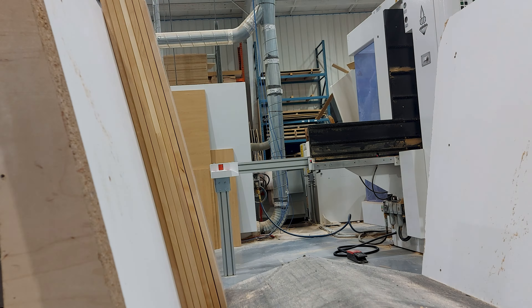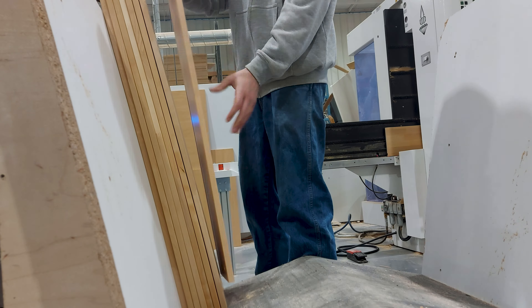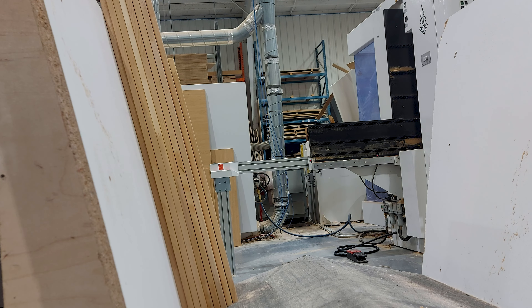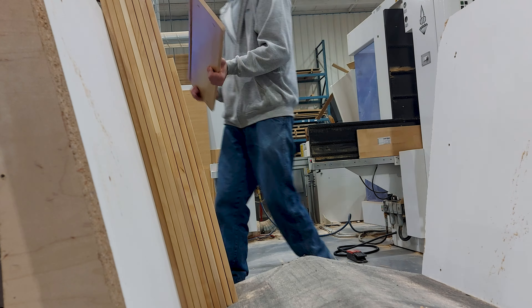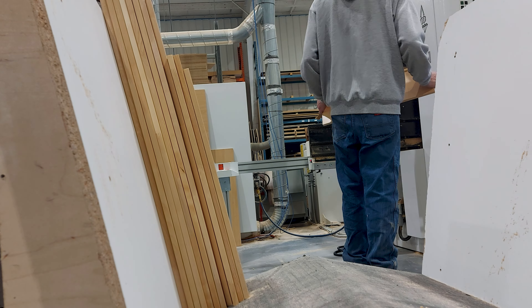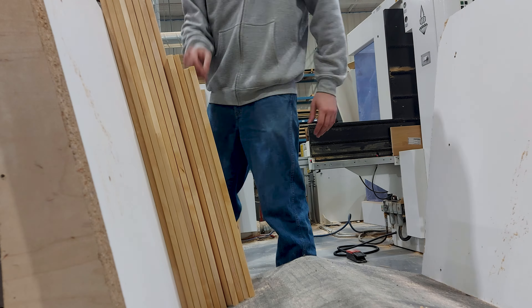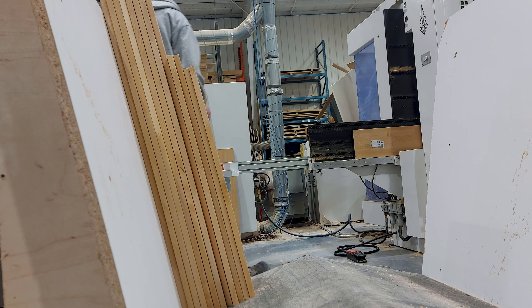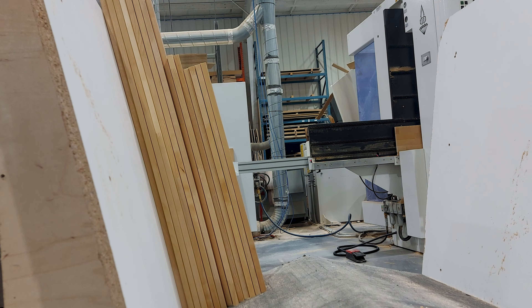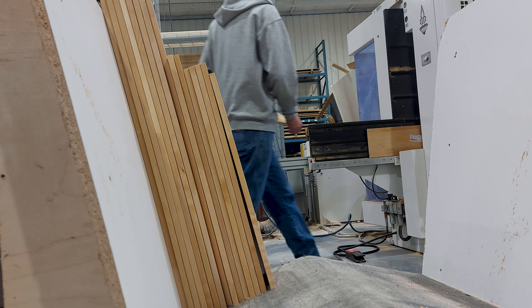The fronts we actually put through our vertical CNC machine because we pre-drill a hole in the front to mount our drawer fronts to the dovetails, so that the assembler does not have to mark out with a pencil at all in order to mount the drawer fronts to the dovetail drawers. It's all done on the machine - we do a pilot hole through the dovetail and also have a marker hole on all of our fronts.